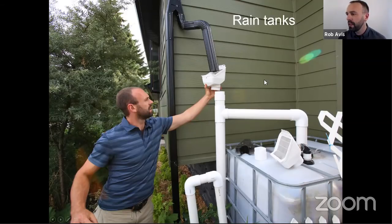The biggest challenge people have with rainwater harvesting systems is that they don't clean the first flush diverter. If you don't do that, you can end up turning that pipe into a septic mess — it literally starts to go septic. We always say: if you're not the maintenance type, don't put on a first flush diverter. Outside of the growing season, we flip the valve and the water moves down into an underground perforated flexible pipe — weeping tile, or a French drain — laid on contour. I've got both videos and blogs on this called 'urban swales.'